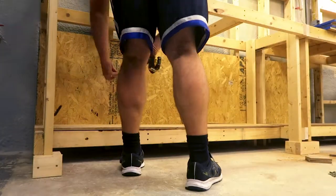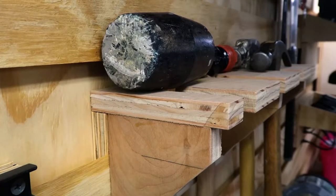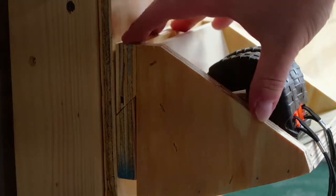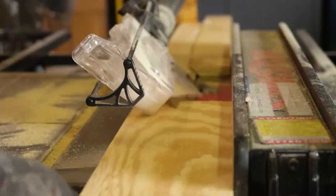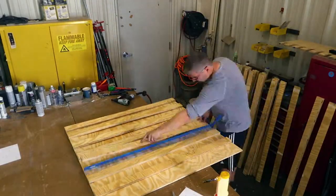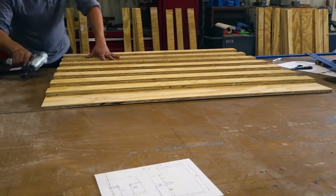This was going to hide the framing and stop stuff from falling or rolling off the back of shelves. Now it was time for what I had been really looking forward to: making the French cleats for all the walls. Using a French cleat basically means you have a part attached to a wall with a bevel and another part with an opposite bevel that will sit on top of it, connected to shelving — it makes for a really strong connection. I cut 3/4 inch plywood into strips and then cut those strips in half with a 45-degree cut. Half the parts got glued and screwed into the plywood attached to the wall framing, and the other halves would be used with shelving for different stuff like tools and supplies. What's nice is we'll be able to move all the shelving around as needed, depending on the different projects we're working on.